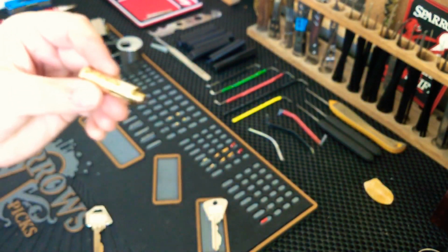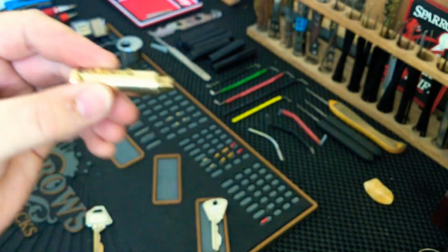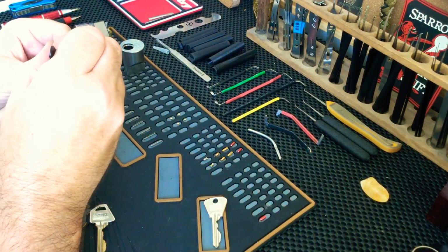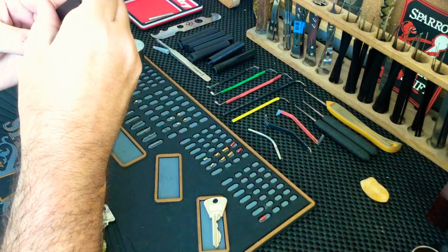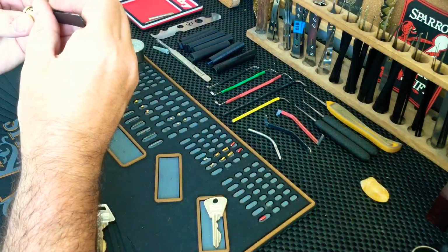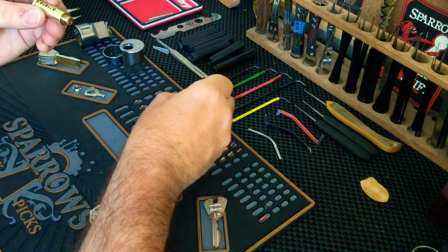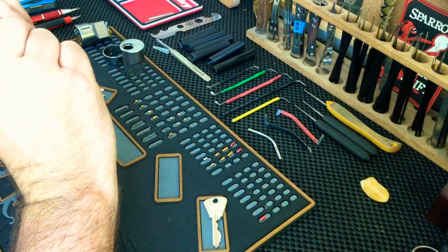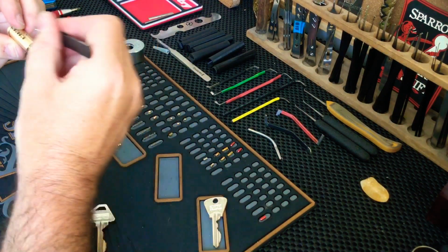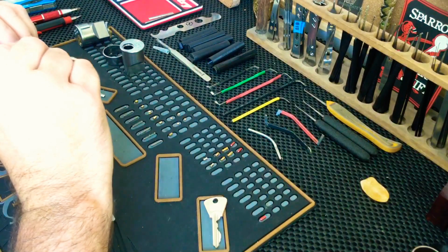Yep, in both cases there you can see they've dropped below the shear line. So what I'm going to do is to remove these first. The problem's going to be with 5 and 6. So I'm just going to try to get the drivers out of 5 first. Keep the fill out also, put him back in. So 5 there, and 6.